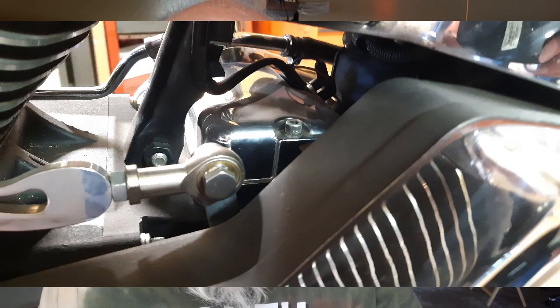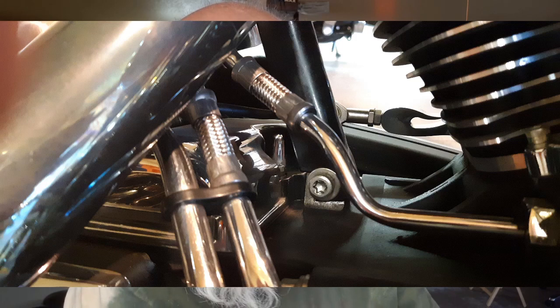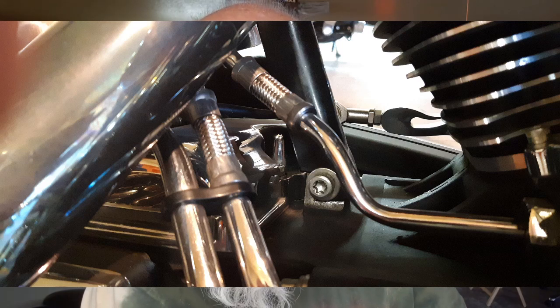I'll put a picture up here so you can see how tight that's wedged in there. The other thing you're going to need to do is the support shaft that comes down to the transmission — you can get in there with your Allen to loosen it, but it's a whole lot easier if you take the bolt out of that support on the transmission and just move that support forward. That way you can get to that one Allen on the top of the transmission on that cover.